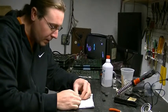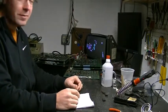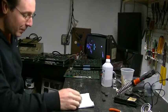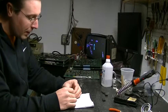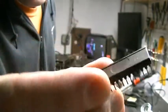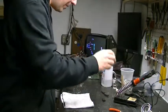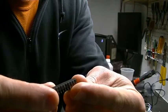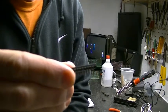Hey everybody, today I'm going to be working on some stuff — mostly Galaga, as you can see I have Galaga boards stacked everywhere in the workshop today. I'm going to tackle something that people have problems with, which is the corrosion on the custom chips. You can see how badly corroded all the legs are, how nasty they are, and this can lead to a lot of problems on the boards. You also get chips where they're so old the legs just fall off like that.